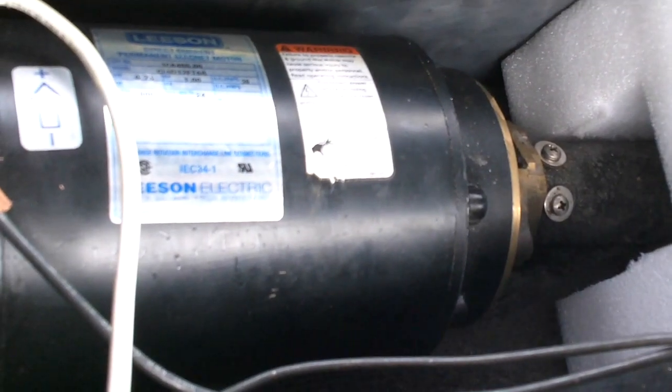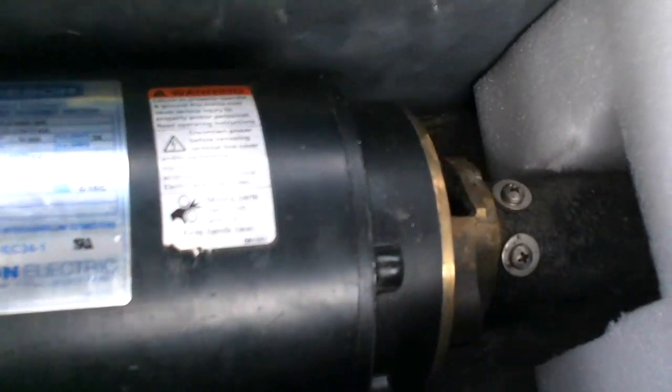So it's making a sound and a vibration. And I think the bolt that's going through the shaft and the motor shaft that holds it all together in here is hitting the brass part. I'm hoping that's what it is, because if it's hitting further down the tube, that's going to be a harder problem to fix. But there is a bunch of dust up here. Yeah, so there's a good chance it's just the nut from that bolt hitting this, which is an easy fix.